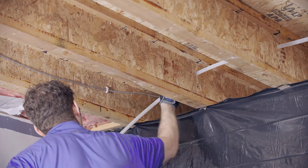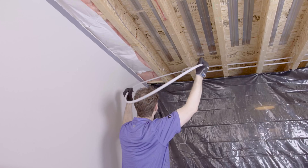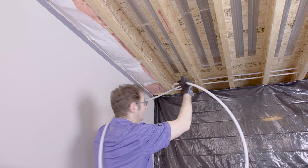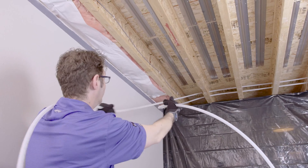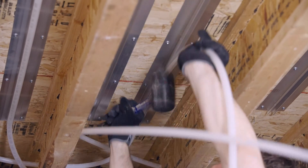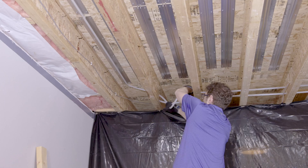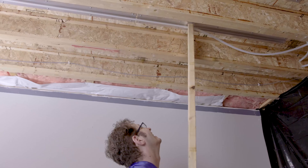Now that the pipe is anchored and roughed in through the supply and return holes, we can install the rest of the pipe using the milk-the-cow method. Simply grab the unanchored pipe and pull as much pipe as needed to complete the loop in the first bay. When you have all the pipe you need, secure it into the joist panels — use a rubber mallet to snap the first piece into place, then take a long board and push the remaining pipe into the channels. You should hear the pipe snap into place. In the next bay, make another loop and continue the process until the entire loop is complete.